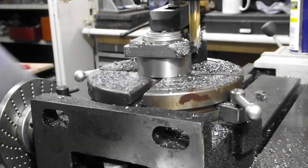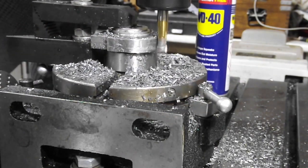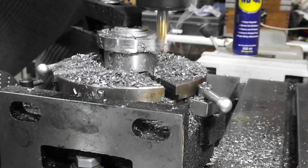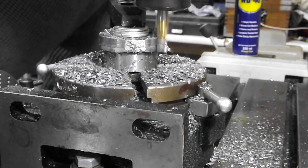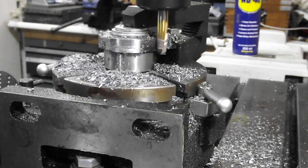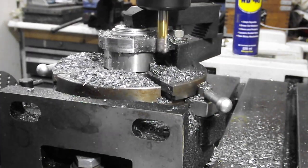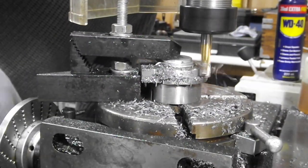I would say that before putting the workpiece on the mill I hacksawed the two shoulder pieces at a touch over 46mm apart. These two pieces fell away after plunge cutting the start and finish cuts. You can also see here that my fear of the workpiece moving had subsided somewhat and I felt a little happier taking bigger cuts.